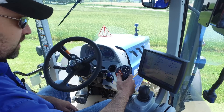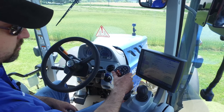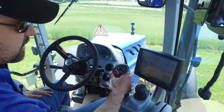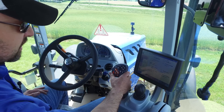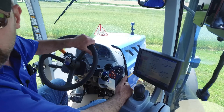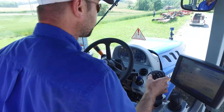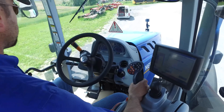So that was range one. You can again cycle up to range two and have an infinite amount of speed ranges there. If I were to come down below two miles per hour in range two, it's going to knock range one down as well — it will always bring the next lower range down to match. You can't go into range one and have it be a higher speed than range two. Range three is set at 26 — this tractor has a max speed of 26 miles per hour. So I'm going to go out in this open space, back up a little bit, go forward and get it going right up to cruise. We're in the forward spot, we hit the cruise button, and off we go.